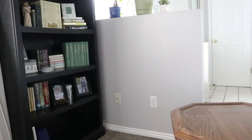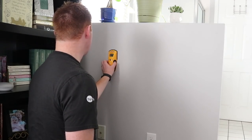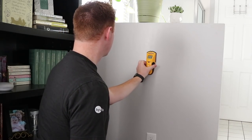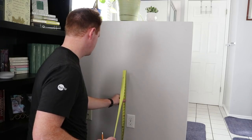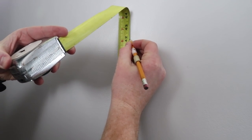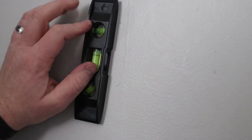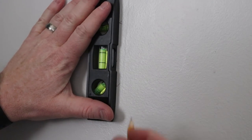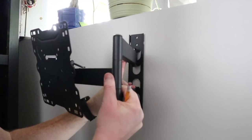One of the main reasons I'm doing this is to get rid of this ancient TV stand. The first thing you need to do is find the stud in the wall. I'm using a stud finder to locate the middle portion of the stud and make a simple mark. Then I find the center of where the TV needs to be, marking it at 42 inches close to where the stud actually is.